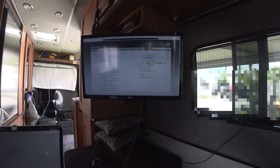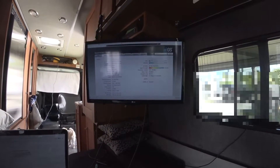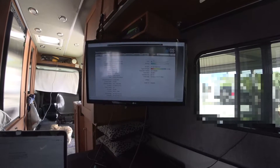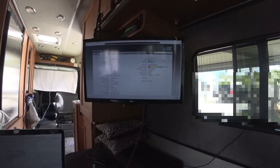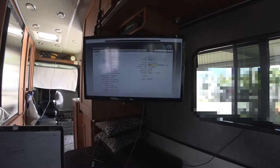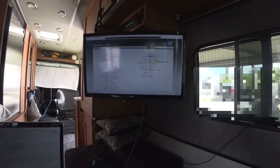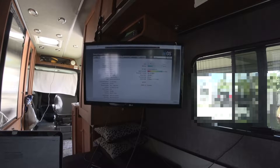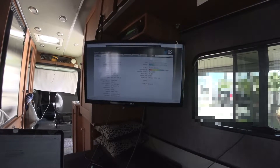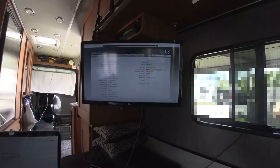You can see my transmit CCQ is still not great — it's around 70 — but this could be because it's moved a little bit from its initial location since it's just sitting on a tripod and probably moves a bit with the wind and trees causing interference. The internet is very stable at this point and my transmit and receive rate is 52 and 57, which is much more reliable than my previous setup.